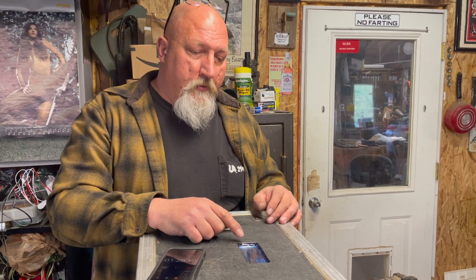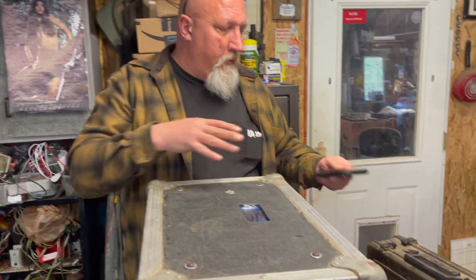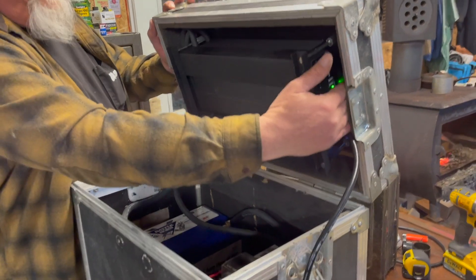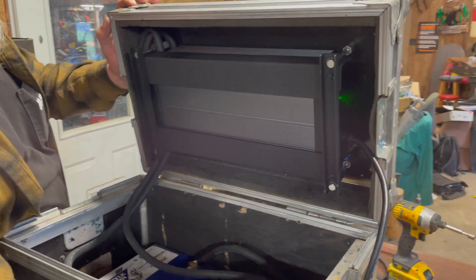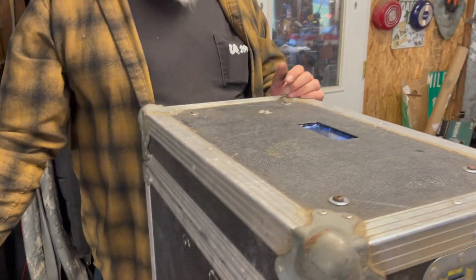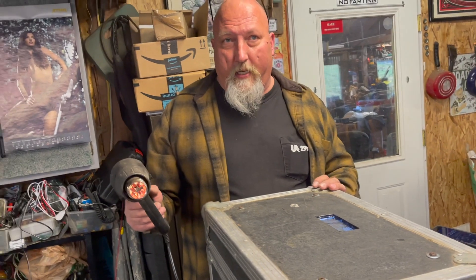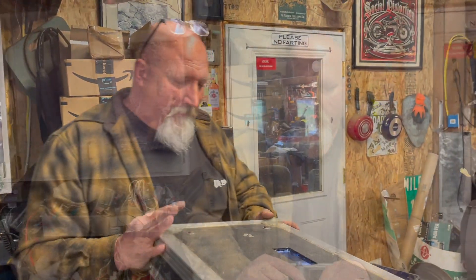We went up from 14 to 18 degrees in this short amount of time and dropped battery voltage from 12.5 to 12.4 volts. We ran a minute and a half. I wanted to test whether those fans were pushers or pullers — I'm going to cut this out, put some screen on this side, and have an air intake down low over here so it draws air up and over all of this. So far, huge win — I was able to run 1,660 watts of load for two minutes and 20 seconds. That's hot freaking awesome. It's alive!